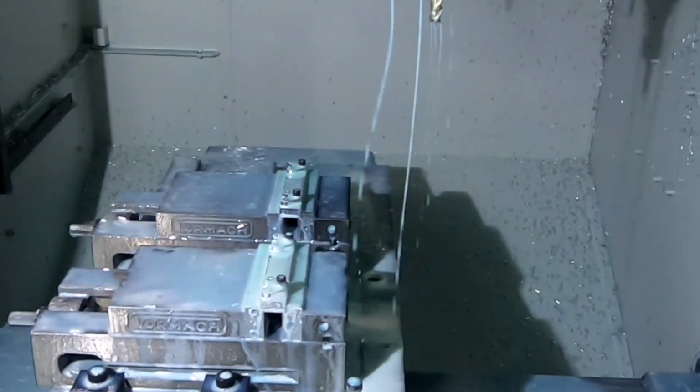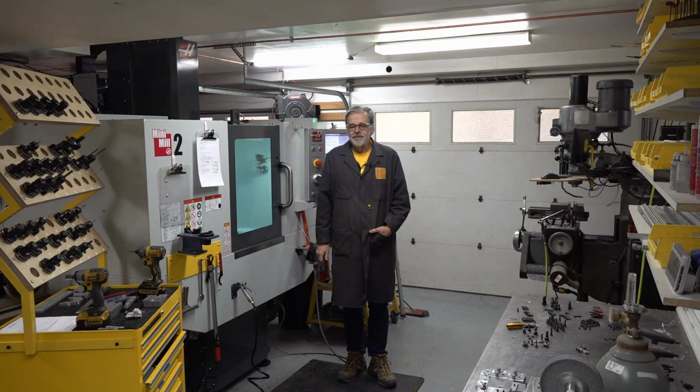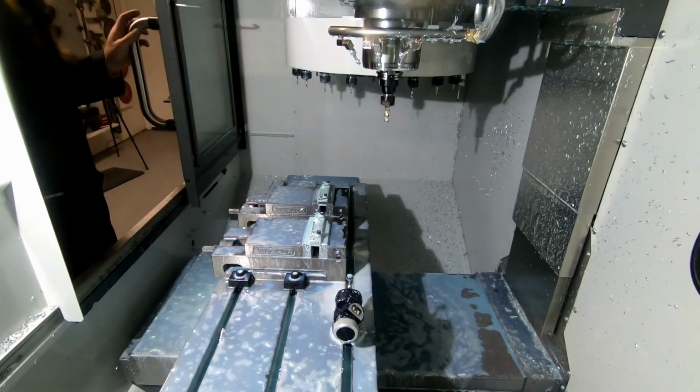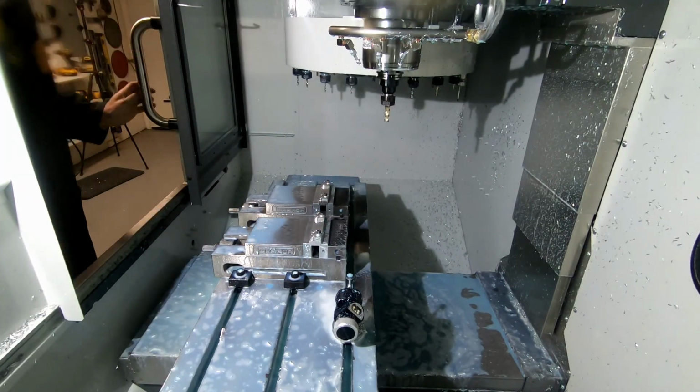is so much faster. When I started making these parts on the Tormach, the tooling plate was a single part tooling plate. I made one part at a time, and doing it in the array of 4 parts has sped the process up so much. It's just amazingly fast. So there we have 4 happy little parts.